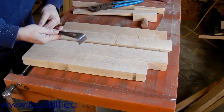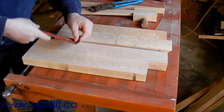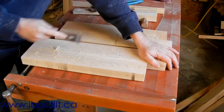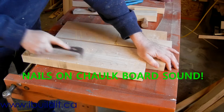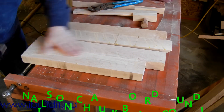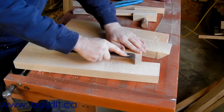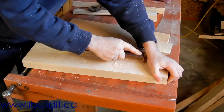These are handy for quite a few things. I keep it sharp on the end here - I don't really use it as a pry bar. It's pretty good for scraping off glue if you keep it sharp. I'm going to scrape the glue off of these and then run them through the planer to get them flattened out and cut them to length.